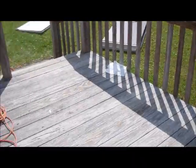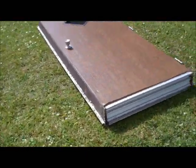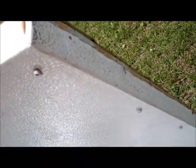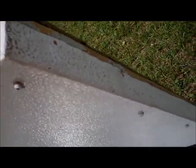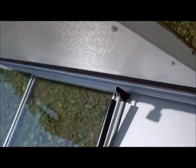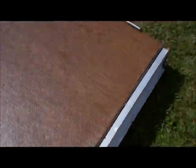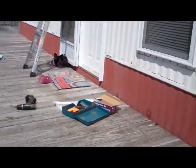We asked ourselves how that other door fit in here, because we put it in the exact same spot. We came out and looked at that door — something we didn't pay attention to was that whoever messed with this door cut the door and removed the sweep. So there's no sweep to keep the water out, and this is all bent and beat up. So this was a longer door and they shortened it and stuck it in here — terrible. You never get a seal across the bottom of your door, and that's the outside of your house.